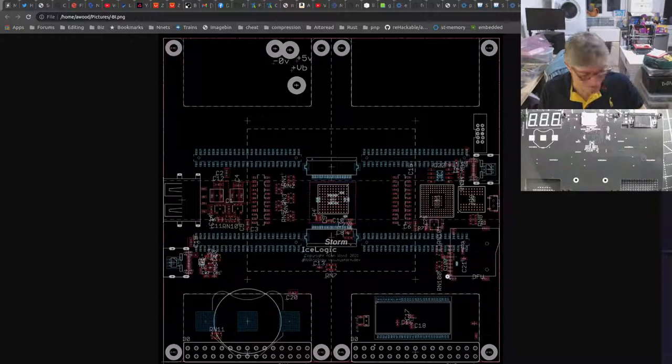That's probably not the answer you were looking for. I think we're out of pins now. We could put LEDs on the same pins as the button pins, which is exactly what we did, I think, on the MX. And yes, you can use them for a simple blinky, although it's slightly more complicated, because you can't just blink one line. You have to enable the segment before you can blink any of the individual LEDs.